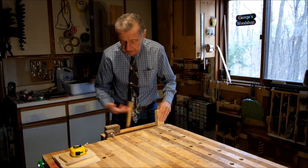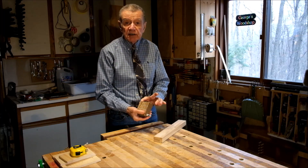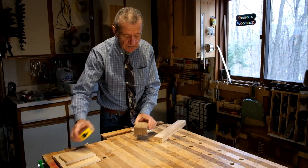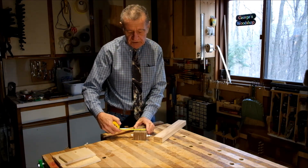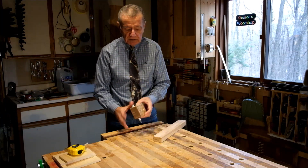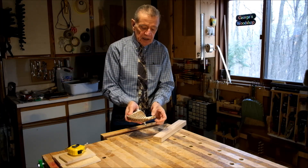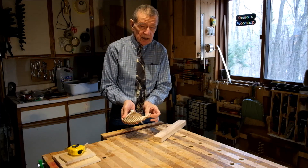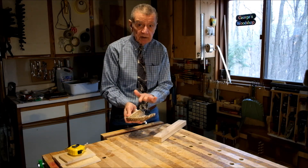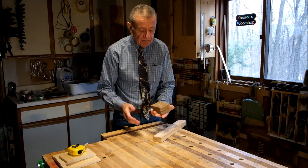Now you can get things like this commercially. Lee Valley, for instance, makes one with four inches of capacity with one-tenth of an inch resolution. This one runs up to just under three inches with one-eighth of an inch resolution, and for the most part it's made up of one-quarter inch thick panels. One-quarter inch would be six millimeters, but this thing has three-millimeter resolution — that is one-eighth of an inch — and it runs out to about three inches or 75 millimeters.